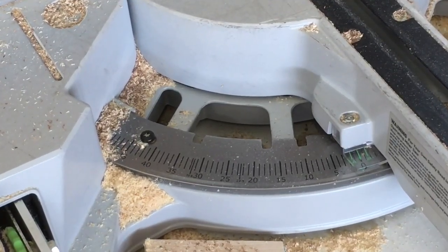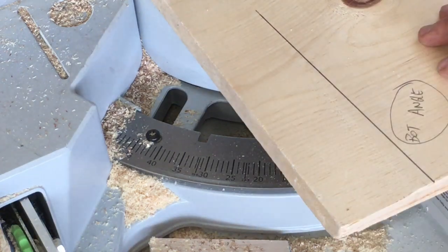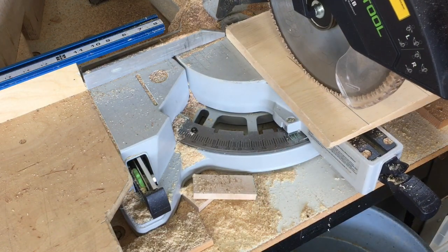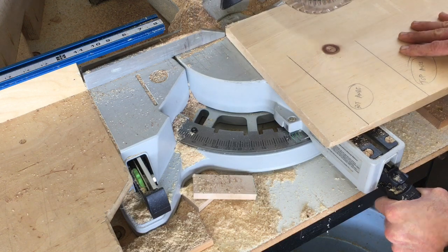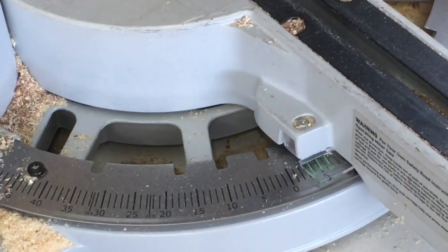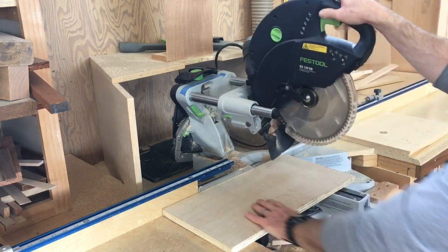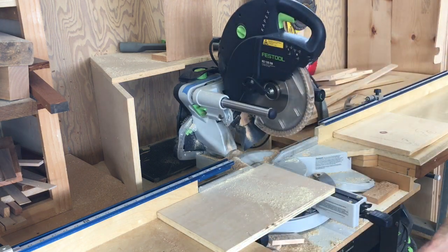The next thing I did was kind of tricky. I went over to our miter saw, which has an angle gauge on it already. I took the scrap piece of wood and using the miter saw I figured out what the angle was. Once I had it figured out, I looked at the bottom of the saw — if you look carefully you can see we're at a five-degree angle. This tells me I need to make a five-degree cut. I know this is all a little confusing, but when we come back tomorrow we'll install this piece of wood and it should make more sense. See you guys then.